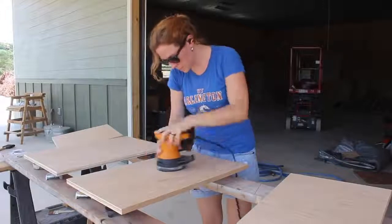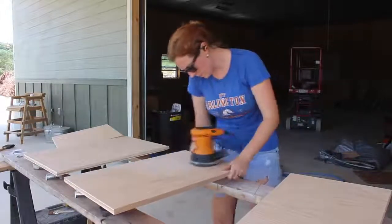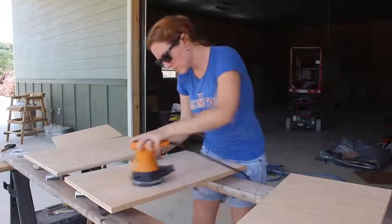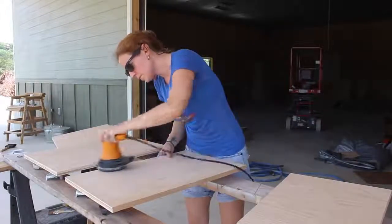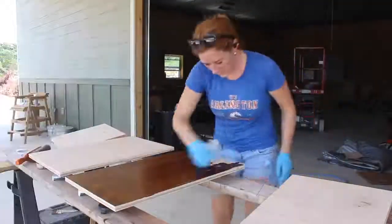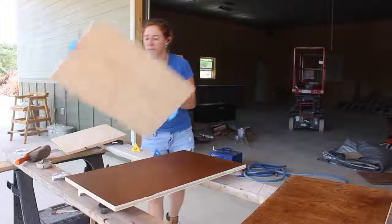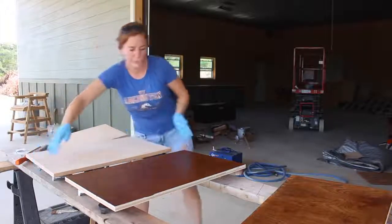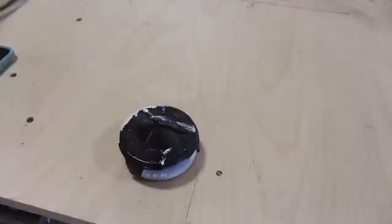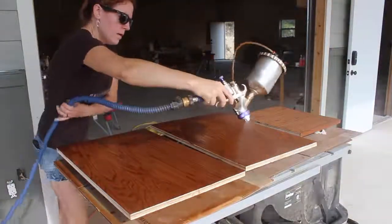To make life a little bit easier, I wanted to stain the parts before assembling them so I wouldn't have to be working in a small confined space while finishing. I placed my four pieces on some bench cookies with the pointed tip attachments and gave everything a light sanding using 220 grit paper. I brushed everything off and wiped on a coat of stain to match the desk, which is a color called Provincial. A tip while staining: start by staining the bottom of your pieces then flip them over and finish the top without having to stop and let things fully dry. I let the stain set, wiped off the excess, then let it sit for a few hours before spraying on a de-wax shellac clear coat.